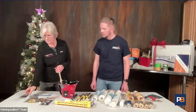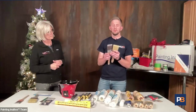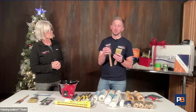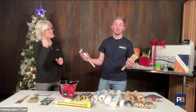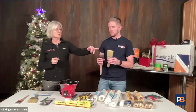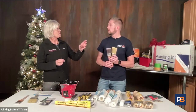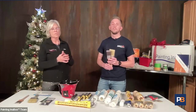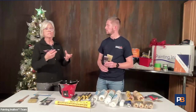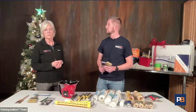Awesome. Real quick, Linda, let's talk about the different materials of the brushes. In our guide you have your natural bristle brushes, which are made out of animal hair, that's the most simple way to put it, and then you have your synthetic brushes made out of different material. The synthetic ones are more for latex, water-based products, and the natural hair ones are more for oil-based products. For stains and oil sealers, say you're staining a piece of wood or some woodwork in your house or a piece of furniture, you want to use that type of brush.